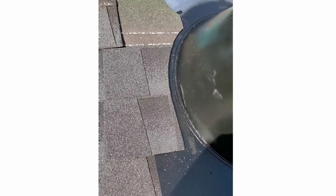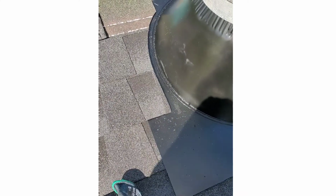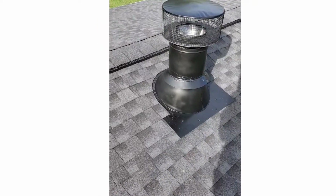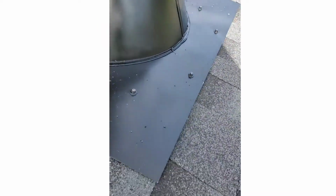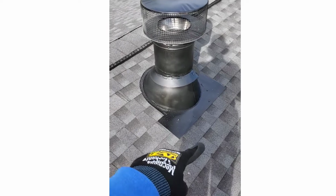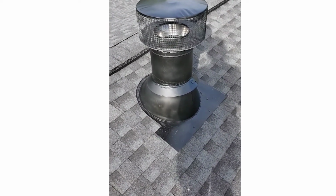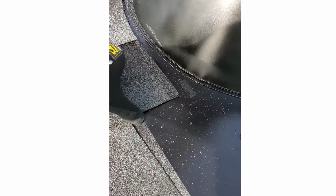This is a pretty big pipe, so we did like 1 inch on that. Give that water plenty of area to move down the roof. Okay. Now that looks much, much better. We went ahead and used a roofing screw because these bases aren't really designed to be replaced every single time. Next roofer can just take those screws out, reuse the flashing, and then put them back in. Plus, those aren't going to wiggle out, and they're sealed to the top so you don't have to caulk them.